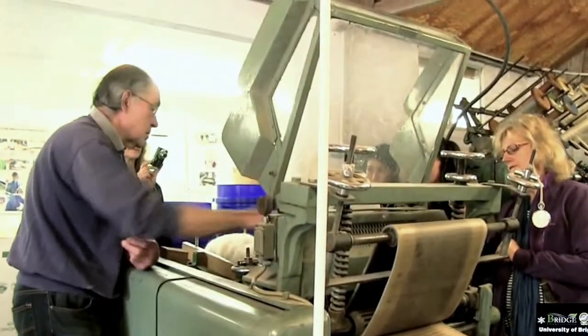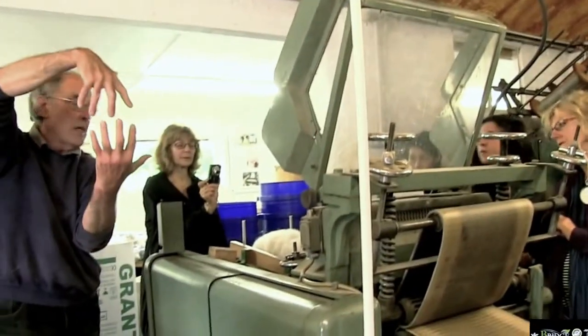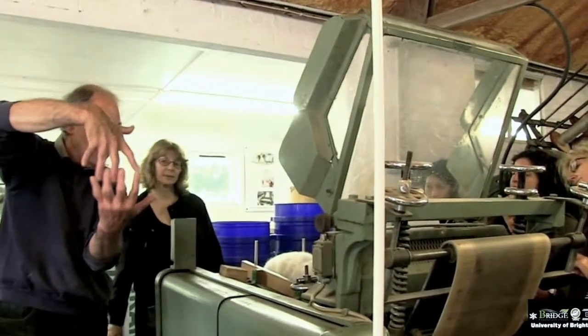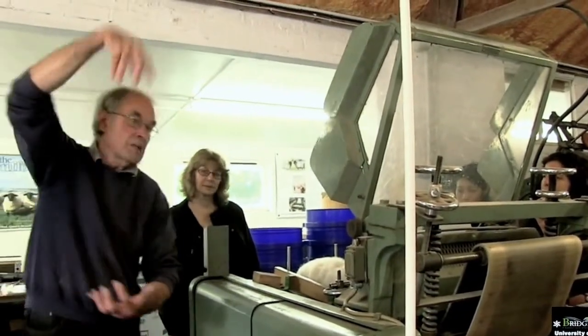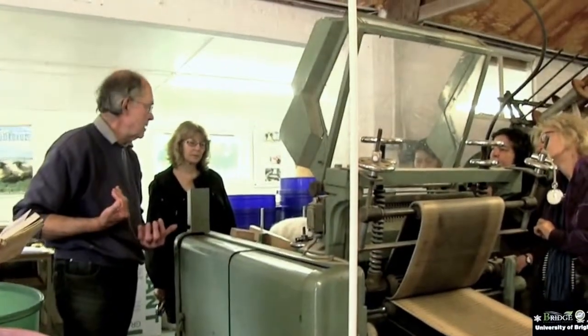It's got two heads, it's got an intersecting gill, and it's like this. It has a bottom row of pins and a top row, and then it's intersecting like that, going round. The top row is going forward and then comes back over the top, and the bottom row goes forward and goes round under the bottom and comes back again.